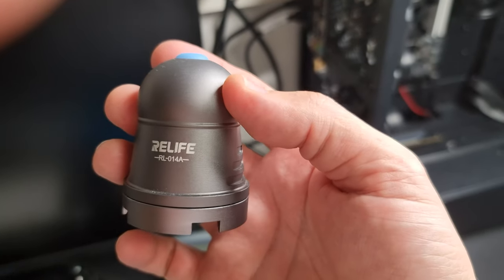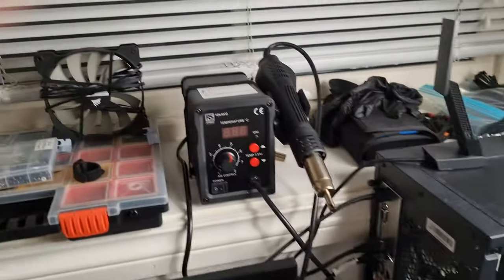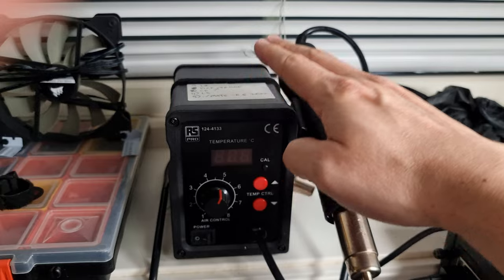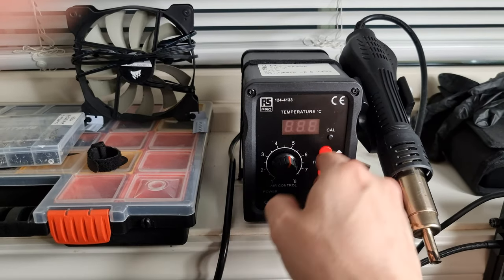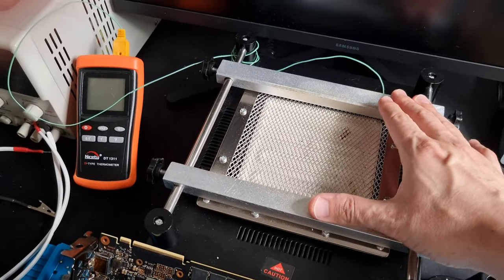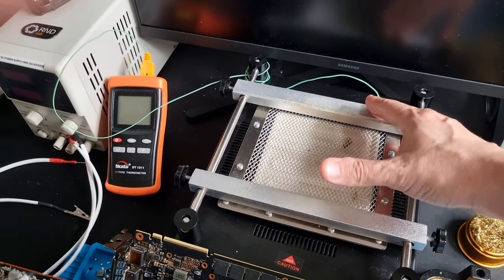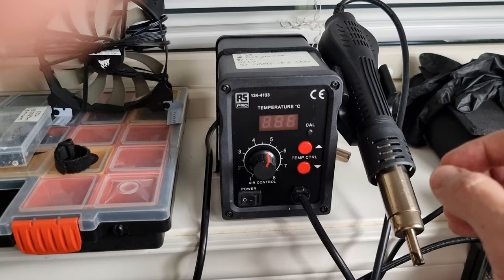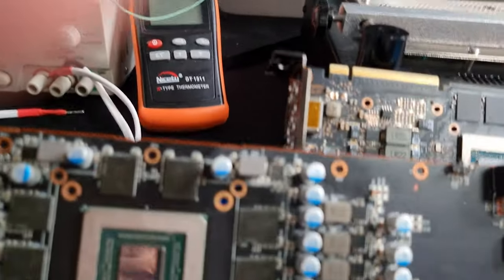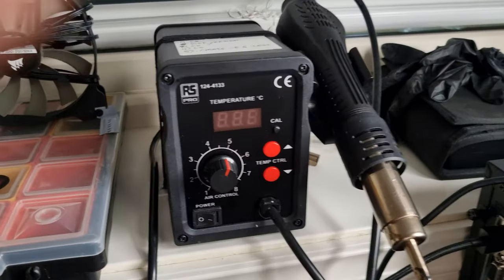Also, this is the UV light I bought from AliExpress — it's called Real Life, it's not expensive, it's USB so you can hook it up to your computer, and it does what it's supposed to do. For your hot air station, it doesn't have to be anything fancy. I keep my hot air at five or six — I hardly ever go to eight — because I also use my preheater in combination. My preheater is always set to 280°C, which gets the board to about 130–140°C, where you really want it.